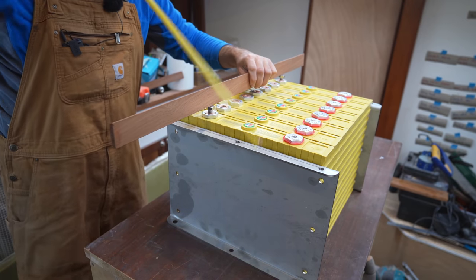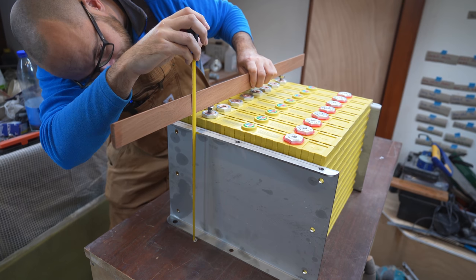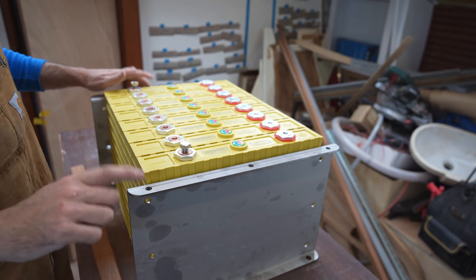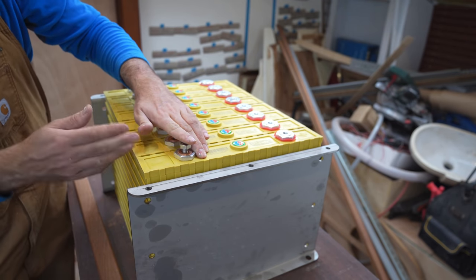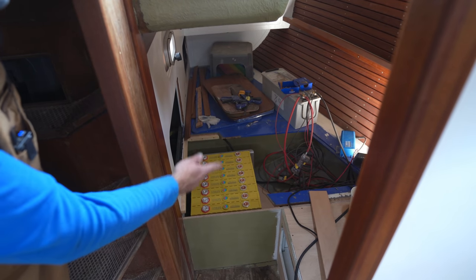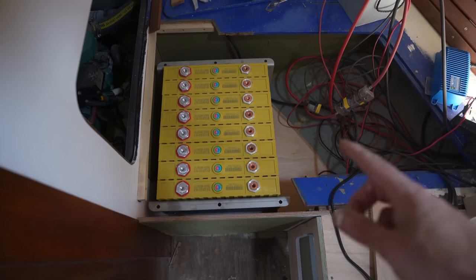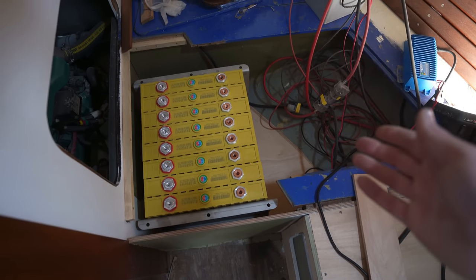So while leaving room for connections to the battery, it looks like I am at 32 centimeters. There's going to be a sheet of plexiglass covering the cells — that's what these three holes on each of the flanges are for. I should still be able to raise the bottom of the battery compartment about two centimeters. After a little bit of fiddling about, I've got a new bottom, and that is roughly where these cells are going to be installed. There is room all the way around the cells for a little bit of air circulation, and there's plenty of room over here for the BMS fuses.